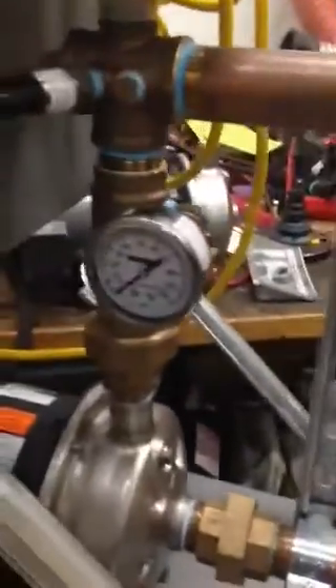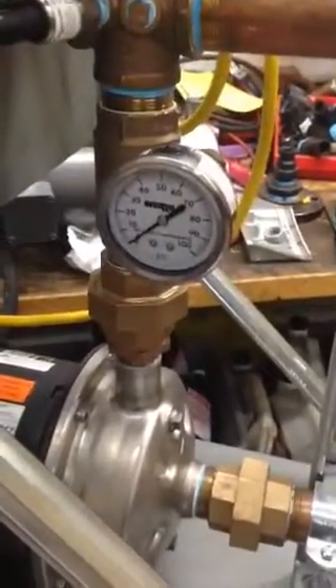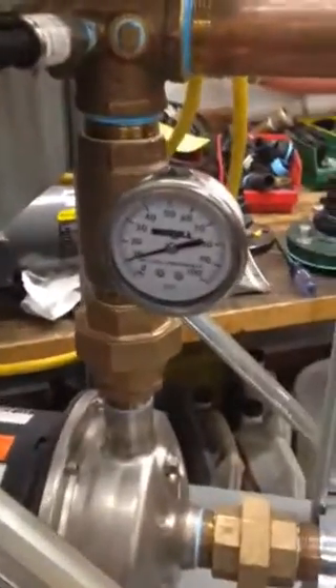The system right here actually has 20 PSI. It's a big centrifugal pump. I'm going to open up this top valve because right now we've got it deadheaded, so the pressure is going to drop. And as the pressure drops, you can see that the VFD is starting to speed up to accommodate that pressure.